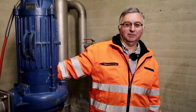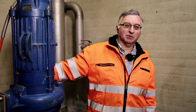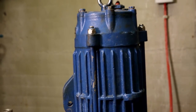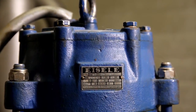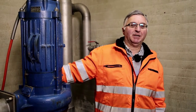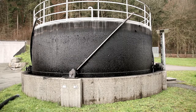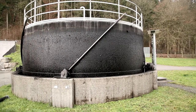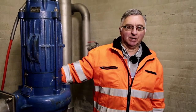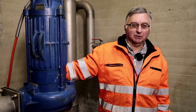This Isler pump is used to mix the thickener. Excess sludge from the digester goes into intermediate storage in the thickener and is agitated so that the sludge has a consistent density for the centrifuge, where the sludge is wrung out. The pump is only used in the dewatering plant when we want to wring out excess sludge, so for several hours each week.